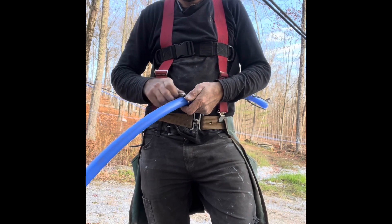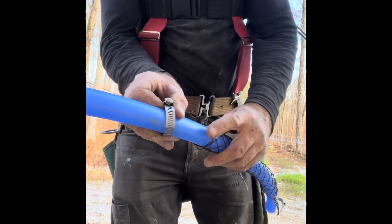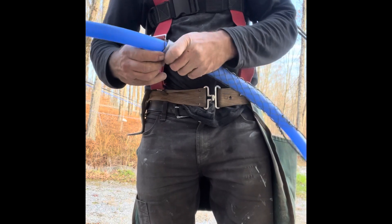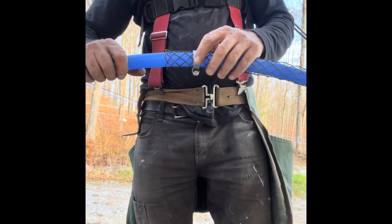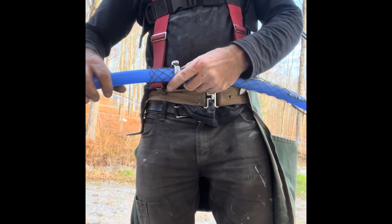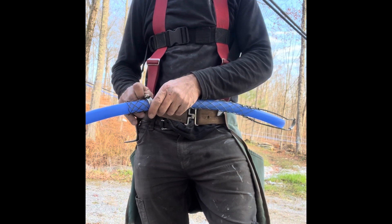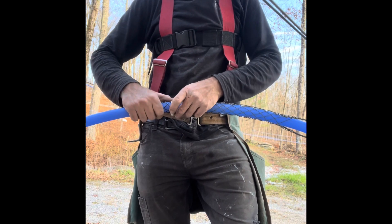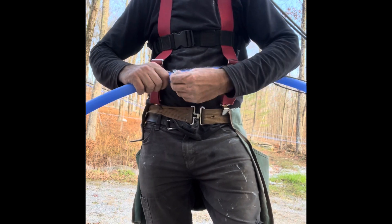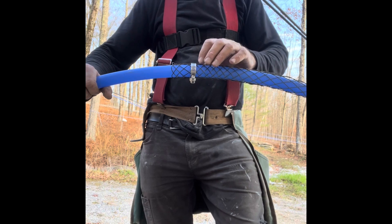So I had the clamp in my hand — I strongly recommend that you put a clamp on here. I have to back it off or I have the wrong size. So you can see the end on this will kind of be like flared out a little bit. No big deal. You can kind of just work the clamp over it. I like to have the clamp an inch or so, inch and a half, even two inches from the end. And you don't need to clamp it down so that the pipe is collapsing — we want it to be a full one inch inside, but you could easily clamp this down and have it be too tight. Really just need to snug fit it. You just snug that up a little bit, and now it really helps this grip into that.